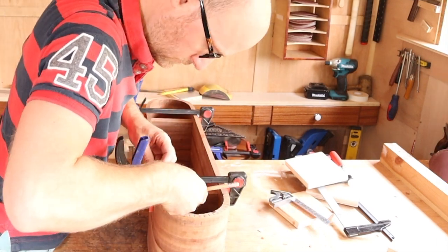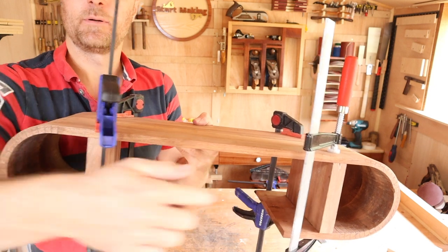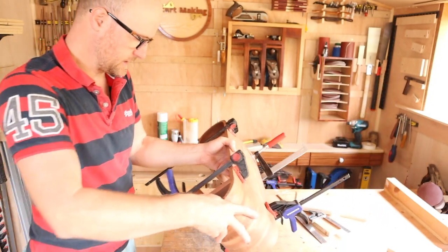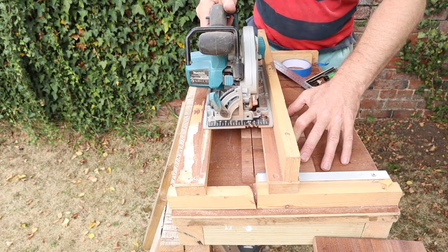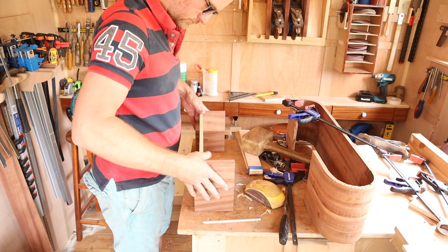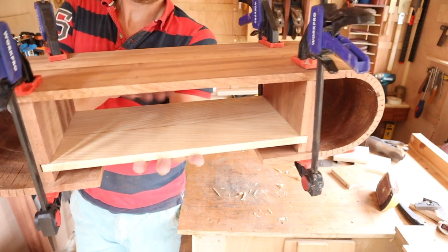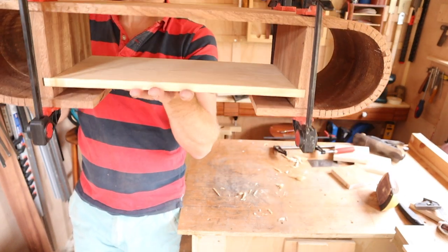It was actually quite a relief to finally know what I was going to do with the two pieces I'd curved. The whole reason for this is to pull these sides up. I need to put a brace support in from here to here so that the whole thing doesn't expand and that'll hold it all together nicely. I wanted to put a shelf in the middle so both of those side pieces needed a dado cutting out of them, again back to the circular saw, and then I slotted in two nice pieces of beech for a bit of contrast. There is the dry fit and if you neatened up the inside of these curves with a scraper and some sandpaper, I think you could leave this with a couple of legs on it - it's a really attractive piece.